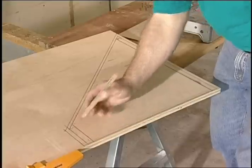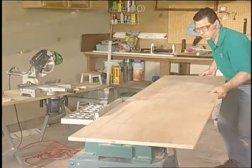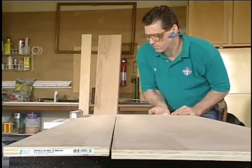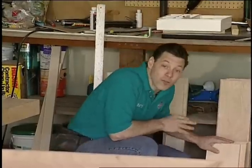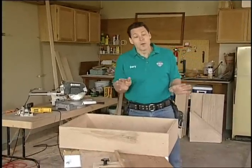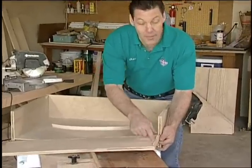This dimension is my short drawer size and this dimension is my long drawer size. We chose three-quarter inch birch plywood for the drawers — it's strong, lightweight, and thick enough to handle the biscuits we're using for the joints. Rip all the pieces to the needed widths and cut them to length. Now there are a lot of different ways to join drawers: you could use dovetails, you could use dowels, but we've chosen a very simple and efficient way — we're going to use biscuit joints. They're strong and really efficient.